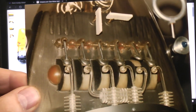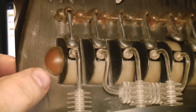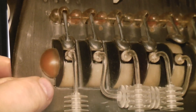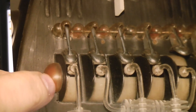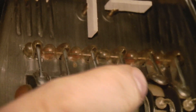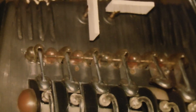What you may find interesting about having a picture with a close-up is you can actually see the metal rod that goes across here. You can see, if you know what you're looking for, that these balls were originally clear and the red was painted. The back of Robbie's head was made out of a styrene that had a rust red color, and the ball was glued on before they painted the gunmetal part. So the rust red shows from behind, and the same is true with the small round divots. The larger ones have a hole because the sax valve goes through there, but these ones were glued on and the red ABS would show behind those.